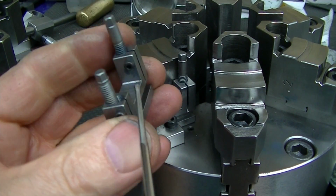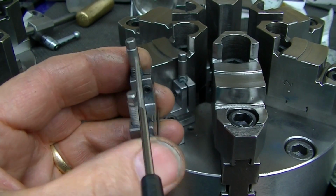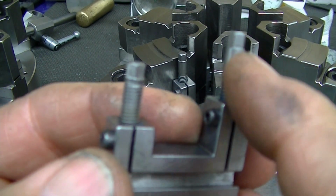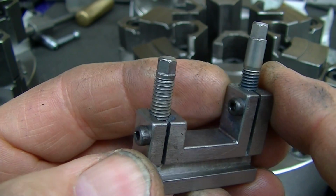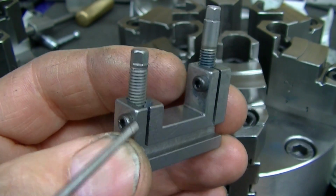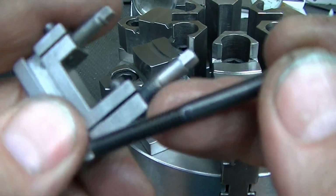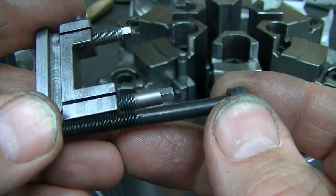The snug principle here, the split with the ability to actually pinch the threads, is very important because these need to stay put and be rigid once you put them in place, and preferably be able to lock them. So that's why we have these 2.5 millimeter pinch screws that actually pinch that like a clamp collar on those threads.